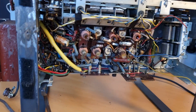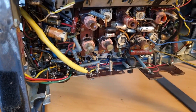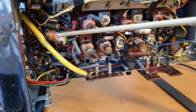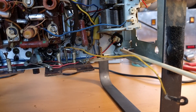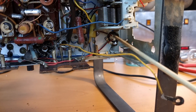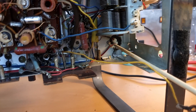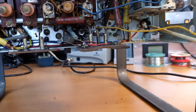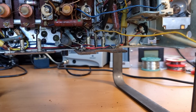At the bottom I don't see a lot of issues at first sight — of course the paper capacitors need to be changed. That's the bottom of the filter can, and the goo is basically coming out. It's leaking quite badly, so that definitely needs to be changed. I don't want to try and power this up before I have at least changed this filter can, because it really doesn't look good.